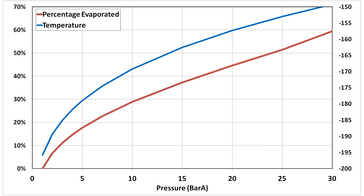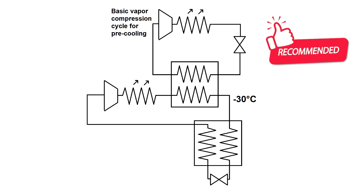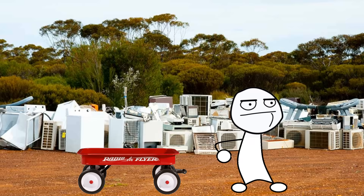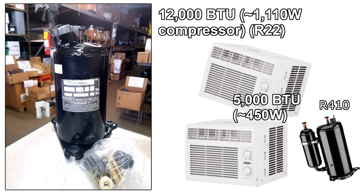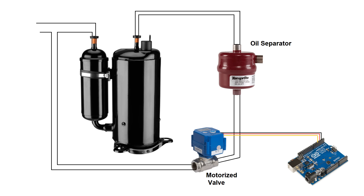A portion of the liquid is lost to evaporation in this process because it's above the one-atmosphere boiling point. For more power and efficiency, a separate vapor compression cycle is used to pre-cool the gas to around minus 25 to minus 30°C before it goes into the counterflow heat exchanger. The system will work without this, but it provides a tremendous boost. The compressors used are taken from window AC units — the main cycle compressor came from a 12,000 BTU unit for R22 refrigerant, and the other two from 5,000 BTU units for R410. There are also oil separators with motorized valves on timers, because oil doesn't move well at cryogenic temperatures and has to be separated out.